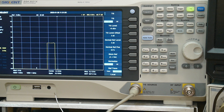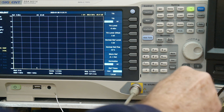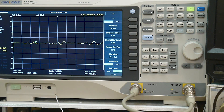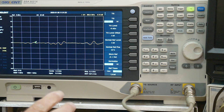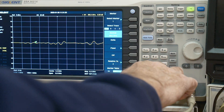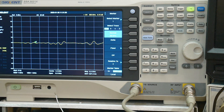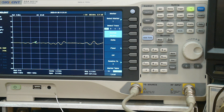We'll take off this connector and put on our BNC to BNC to BNC to BNC, and we'll see how it does. It's got some wigglies to it, but this is 2 dB per division, so they're less than 1 dB of error anywhere along the way. Let me put a marker right at exactly 800 megahertz. That marker is at 800 megahertz and you can see it's doing great to 800, and in fact it does fairly decently all the way up to 3.2 gigahertz.